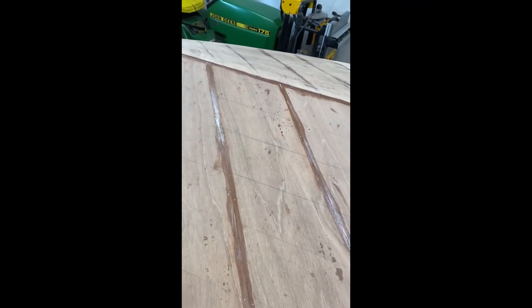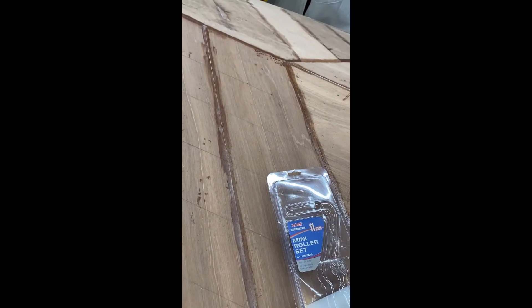I'll run a row — here I ran two rows. Before nailing I slide the boards around a little to make sure the epoxy is spread around well. As I'm nailing, I press down with my left hand around the area and then press down with the nailer. I get a little squeeze-out along the edges, which is good to see.